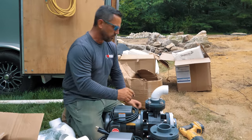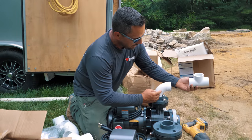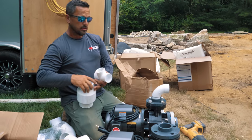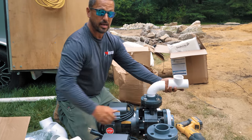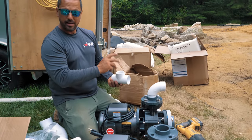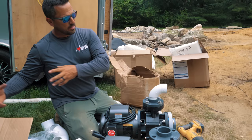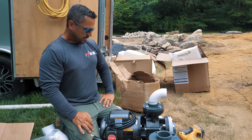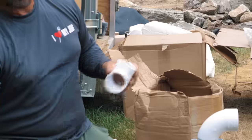The reason that's important is because we're going to take a garden hose and fill up inside here — we need to prime this pump. We put the garden hose in, it's going to go through all this plumbing all the way back to the pump vault, and it's going to hit our check valve that's closed. That's going to allow us to flood all that plumbing all the way up to here. When we're done, there should be water coming out of this thing. Then we go ahead and put our cap back on and fire it up. All that water in the line is going to allow the pump to create a vacuum and pull the water out of the pond, send it up the line to feed our jets, our wetlands, our waterfalls, all that kind of stuff. So that's the important part right here — this and this, the check valve and the priming T. Without those, you ain't getting this thing running. That's all I've got for pumps.